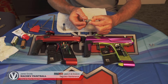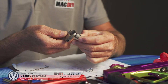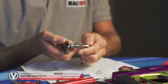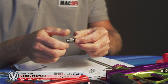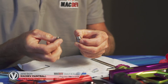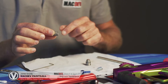Split the bottom works assembly apart. We're going to need a crescent wrench and the large allen key. Tighten the crescent wrench onto the top on the flats, take the big allen key and split it in half. Unscrew your top. You can take off your filter, give it a clean, and slide it back on when you're done so it doesn't get crushed.